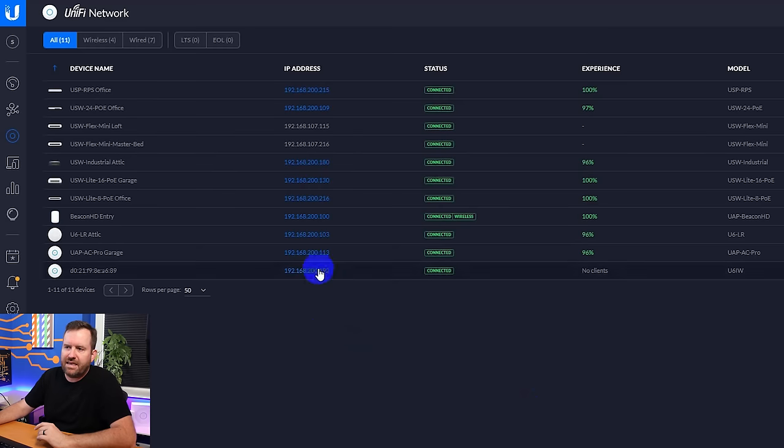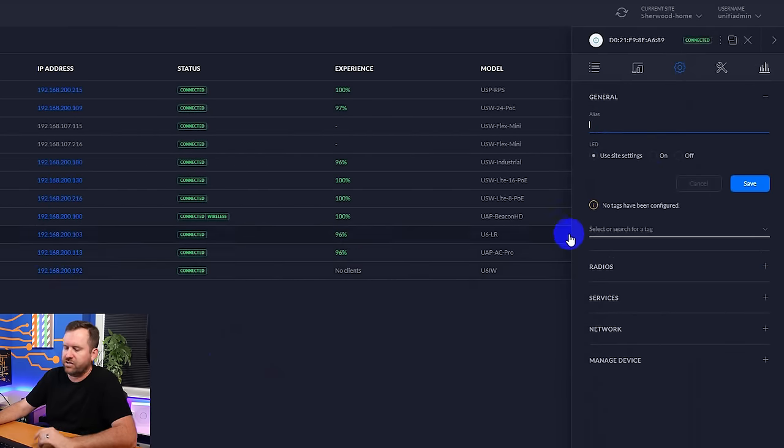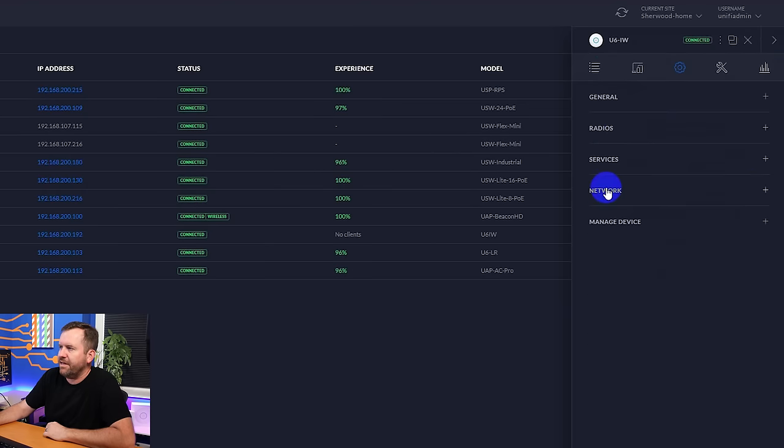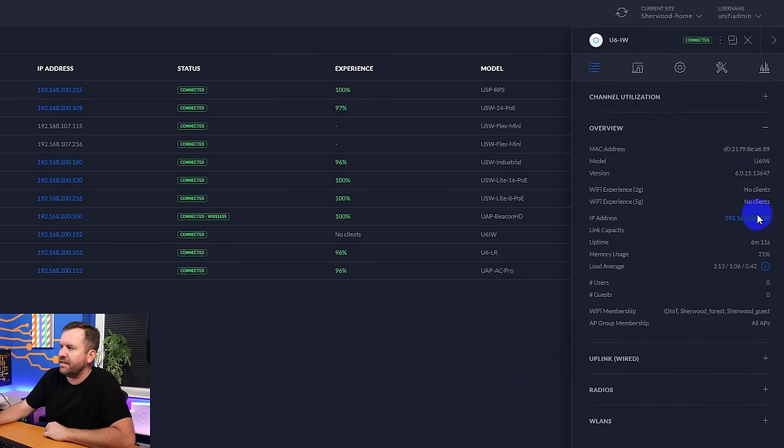Okay, and as I did that, it looks like the U6-In wall has finished adoption, so I'm gonna click on it here. The first thing I wanna do is change the name. We're just gonna say U6-In wall and save that. And then for now, we're just gonna leave everything else absolutely default. We can see its IP address, and it looks like it's not updating firmware, so it must be on a good version. Okay, so all of that being said, the next thing we need to do is uninstall my UAP-IW-HD and replace it with this U6-In. I'm gonna go ahead and do that next.